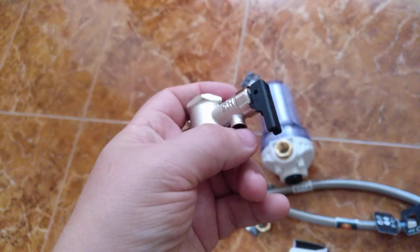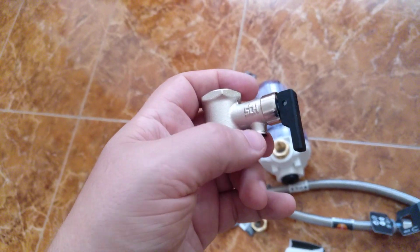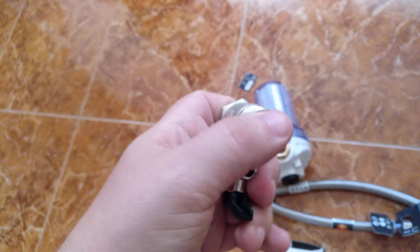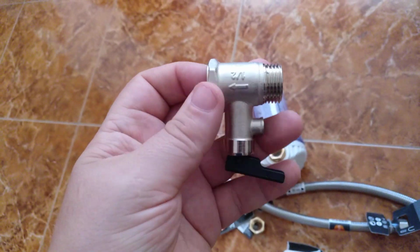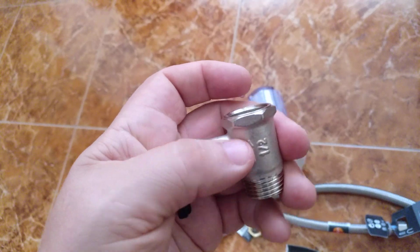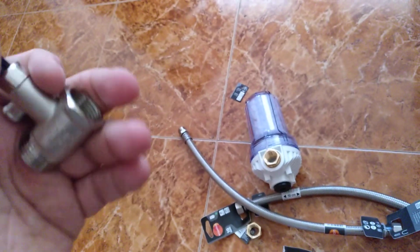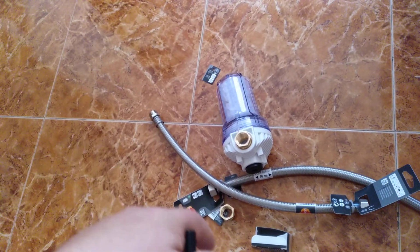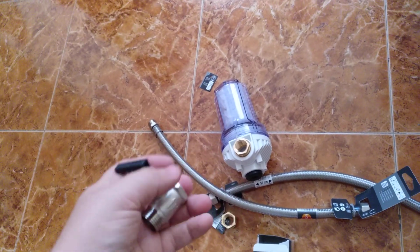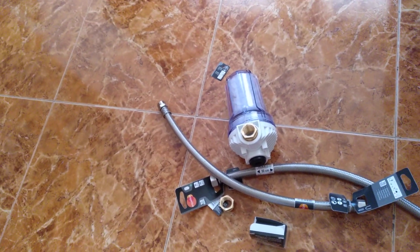Normally you don't really get that on solar water heaters these days, but they have a separate valve on that for solar water heaters that go on the roofs. But it doesn't hurt to put a valve in there just to protect the system, but it also gives you somewhere to shut it off when you want to disconnect and change things. Or for example, you want to switch this off, and then you've got another valve the other side, so you can disconnect this, so you can empty it out and refill it.